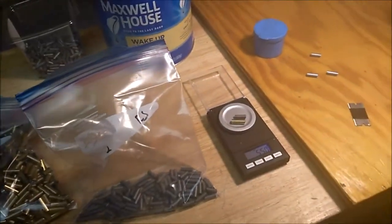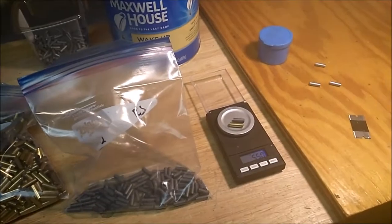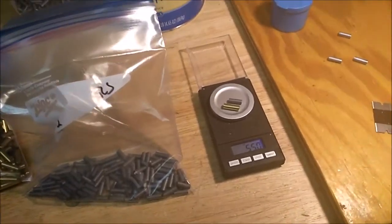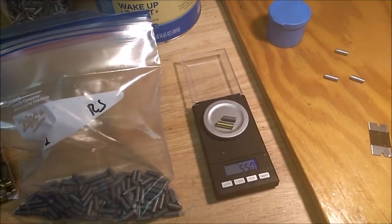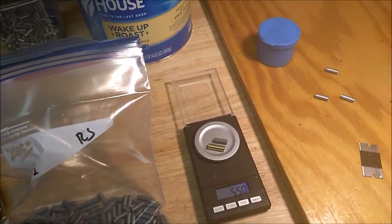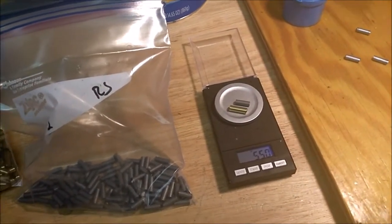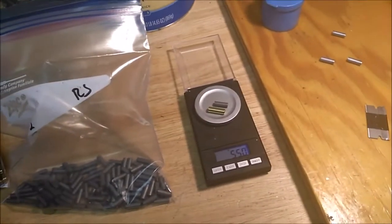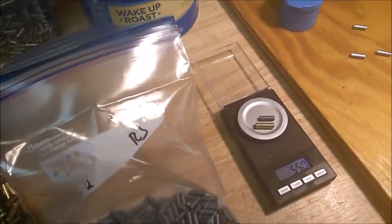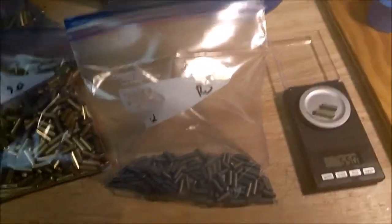According to Corbin's site, you want to be within plus or minus 0.5% for accuracy. So on 55, it's 0.275 grain. You can be off, and you're fine. So almost 3/10 of a grain. So it's not too bad. And dividing it up makes it pretty easy. Alright, on to that core shaker.